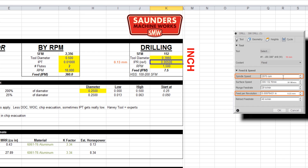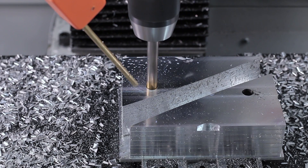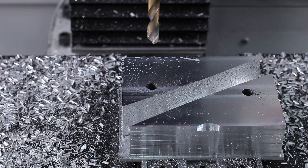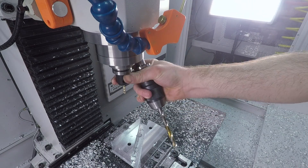When you start getting into lower RPMs on the Tormach — especially the 770 and the 440, or any of your other import or low-powered machines — they don't always have great torque at lower RPMs. So if I had to run this, I would consider dropping it into low belt pretty quickly, run this, and then move it back up to the high belt. You've got to get the lower speed for twist drills.